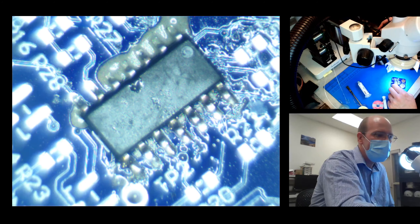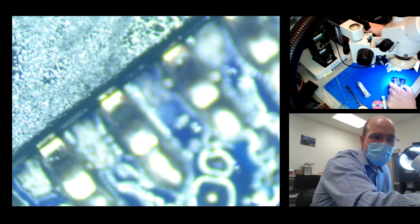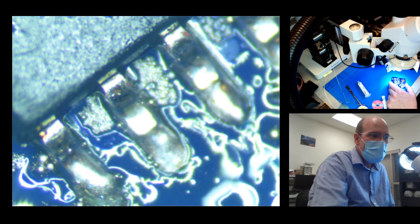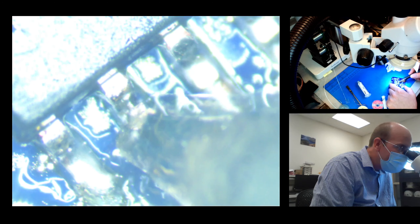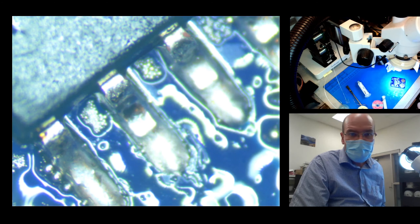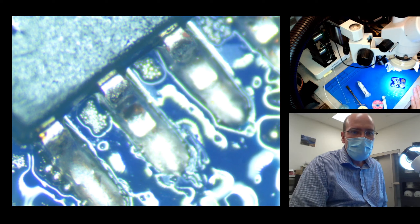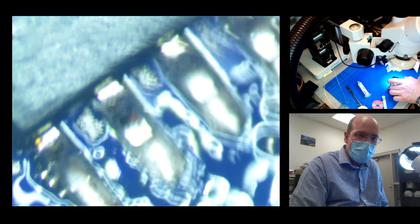You can kind of see the little solder balls in here as we apply heat — they kind of melt together into the pin. We sometimes have to brush them a little bit, and we don't want to hold the iron too long. Those little islands of solder we do want to clean off — solder balls in flux are still conductive even if they didn't fully melt to the pin. We'll want to make sure those are cleaned off afterwards so we don't have leftover conducting balls on the board surface.